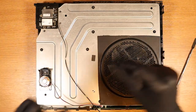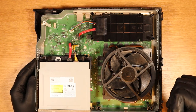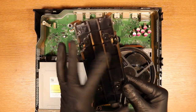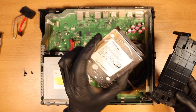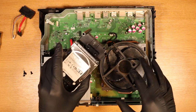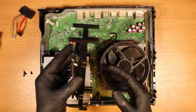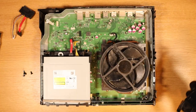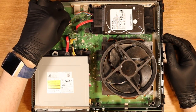Now it's time for a lot of screws. And as expected, no hard drive. This is the hard drive bay where it usually sits and there's nothing there — they also haven't included the screws. Usually you'd have screws here, here, here, and here — four of them. Luckily I have spare screws. I'm going to take the new hard drive, literally just out of the packet, and place it onto the hard drive tray. Supposedly fresh out of the box I should be able to put this in. I've now screwed it in and I'm going to place it back into the Xbox, seat it down, and plug in the power and data. New hard drive has been installed.